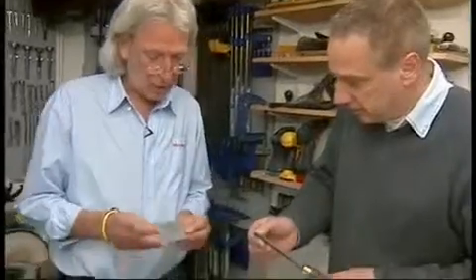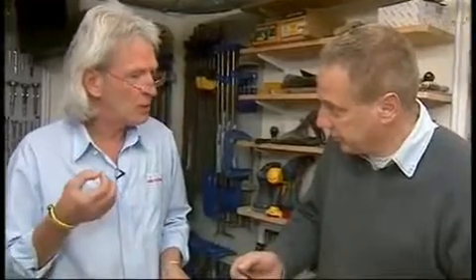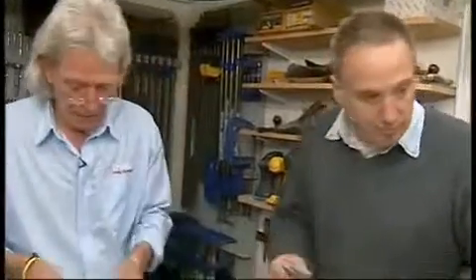So many of the professional woodturners in the UK are using these already, because you can just keep one in your shirt pocket. If you are doing woodturning, what I would suggest is that the majority of the time you're using the coarse side, because you need more of a coarse sharp edge — more like a wire edge. A sharp sharp edge would probably be too sharp for woodturning; the edge just disappears.